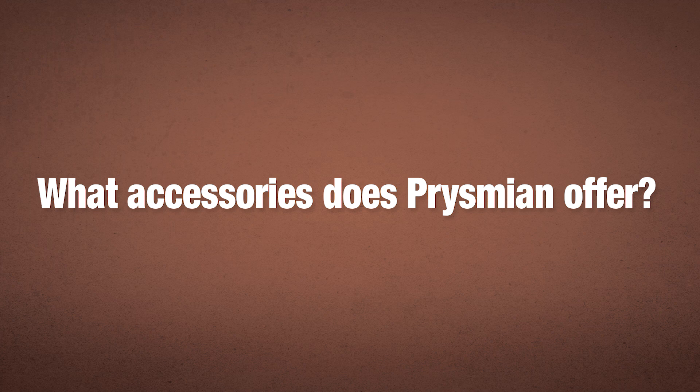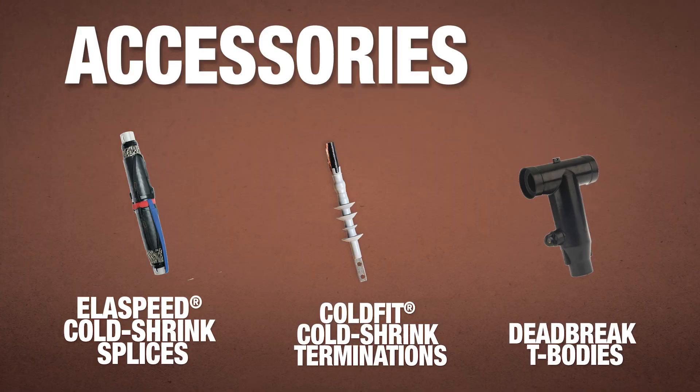When we talk about accessories and tools, what does Prismian offer? Prismian is unique in that we're the only wire and cable manufacturer that not only makes low voltage to high voltage cable, we also make all the tools, splices, and termination kits — no one else does that. We're able to be a one-stop shop for a cable installation. With medium voltage cable, we have terminations and accessories up to 69 kV, all the glands, terminations, and splices. We make the best splice in the market, hands down. Because of the long lengths we can achieve, in many cases we can do a pull without a splice, which is a big cost-saver and provides a very reliable installation.